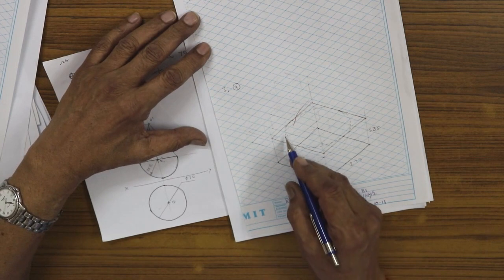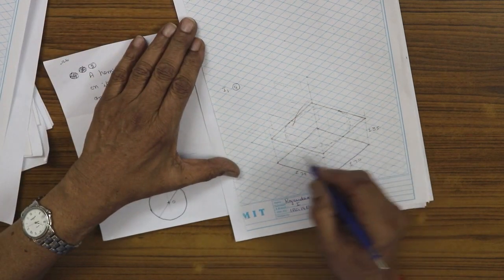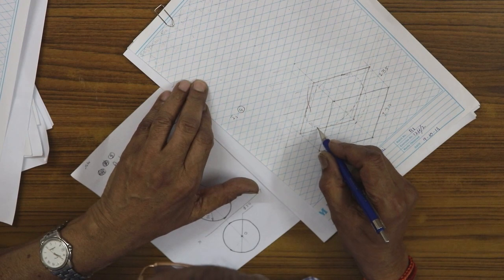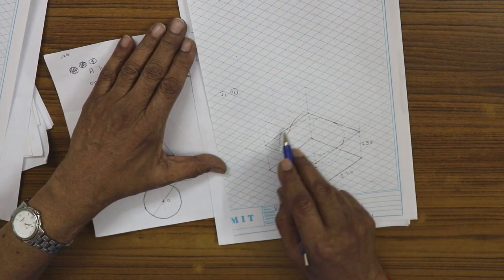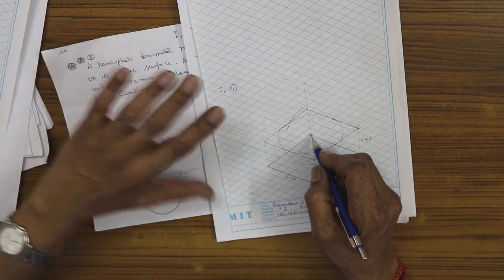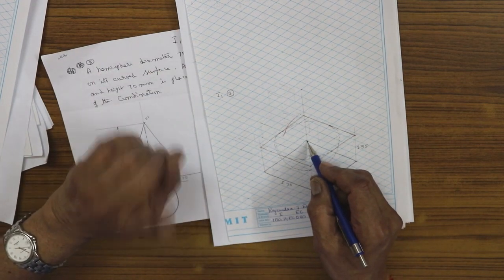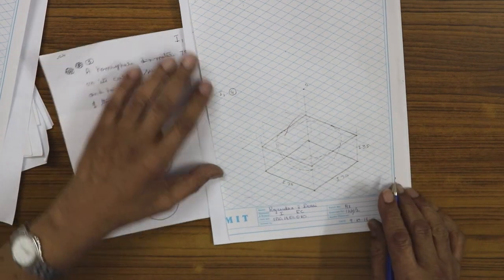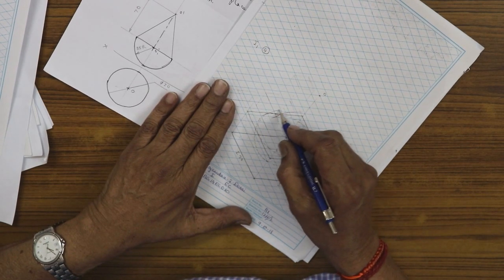The hemisphere's bottom portion uses the same center. With that same center and an actual radius of 35 mm, draw the bottom circle of the hemisphere. The top cut portion is the 70 mm ellipse drawn earlier. For the cone, measure 70 mm height from the center of the base — always measure from the center of the base for a cone or pyramid. Mark that apex point.